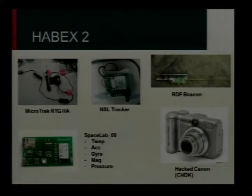But I bought two of these MicroTrack radios made by Bionics and tested the living daylights out of the thing. I beat up one of them. I gave it overvolt, undervolt, killed the GPS. I actually got in contact with one of the engineers who built it. And I did a circuit analysis and sent it to them of, okay, this is what happens if the temperature gets cold.